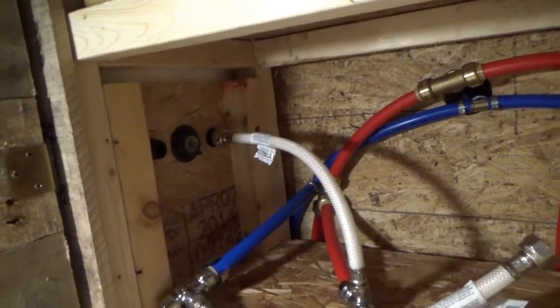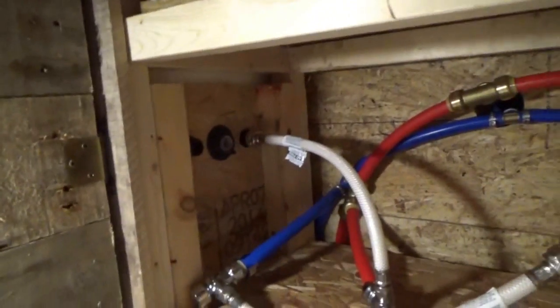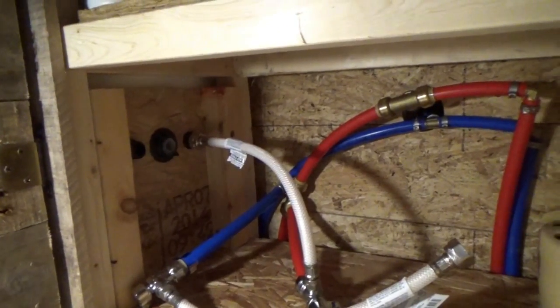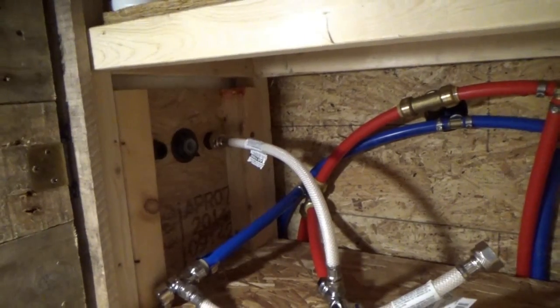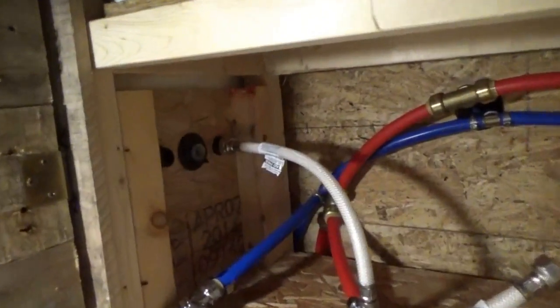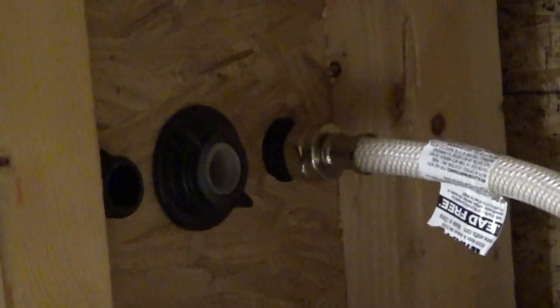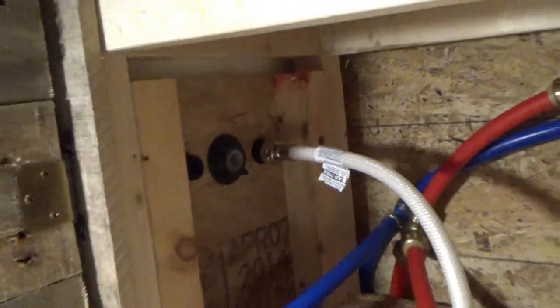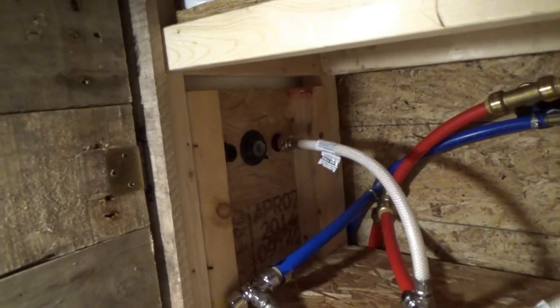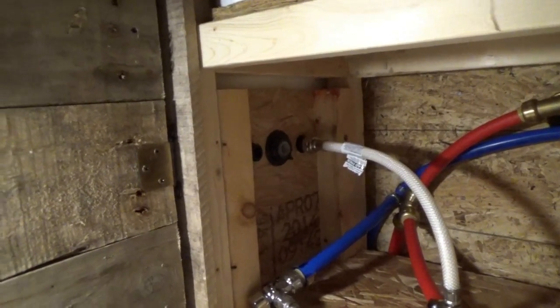It was designed to go on this flimsy, thin little plastic stuff you can put a butter knife through. That nut was designed to fit tight to the plastic and then have room for the faucet. You can see with the nut on there, there's no room for the fitting of the water connection. There was no space extra. None at all. So I'm going to have to go get a thin nut. I might actually still have time yet. Ugh. I'll get it later. I gotta go into town anyway, I guess.